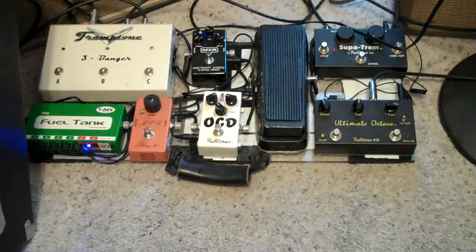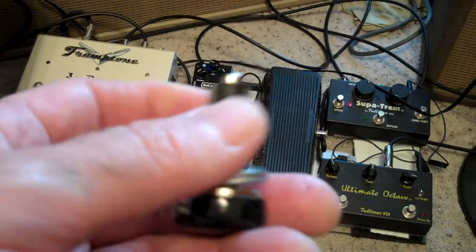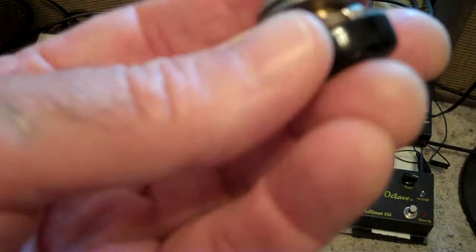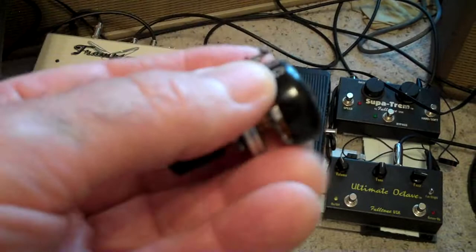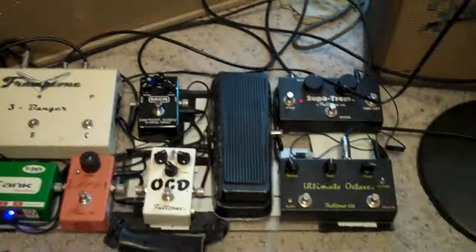I'll play it in a few seconds. That's what I wanted to help you guys with. You can get new pots for your Wah, which if you use it a lot, you need to change these things quite often — at least once a year. This is the correct S-Taper I-CAR pot used in Wahs. You need to get this one for your Wah to work correctly. I get this from Area51AudioDesign.com, which is the maker of my Wah right there, the Area51.